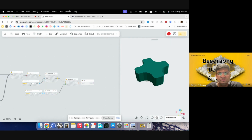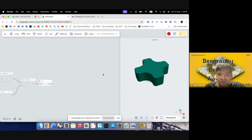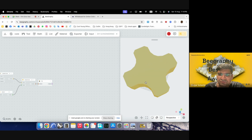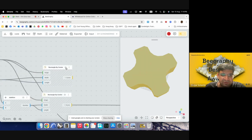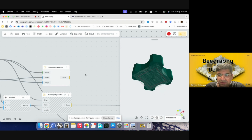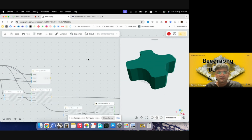Preview off. Now, okay, so we have something closer to what we have here, but then you can see there are parts which are subtracted from this geometry. So the first part is we require a housing for the chip on the top, and then we require a housing for the battery on the bottom. So we can start with, I think, the chip first. So we'll go with solid operations. We are required to make a rectangle above here, and then we'll subtract the rectangle from the body. So if I go back, I already have that rectangle ready. It's on the base. Now I would like to move this up to this part because I want to subtract it from the top. So I'll use move.